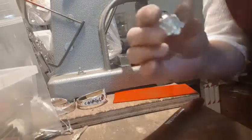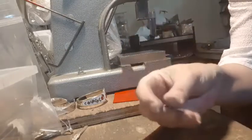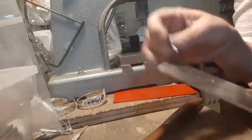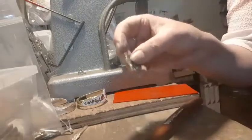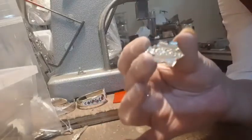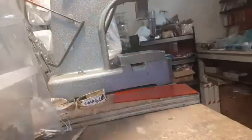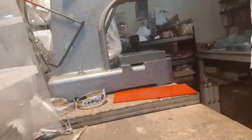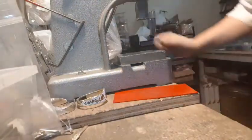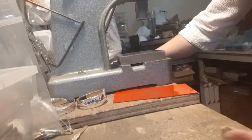So that's going to show you a little tiny flower. He's a little bit stubborn — he kind of curls up — and that's going to show you the intricate detail of some of the flowers. It shows you the little burrs — there are little tiny burrs, so they just have to be filed away. That is one way of cutting these out. I use these pancake dies on my spoon bowls too. Just be careful with the thickness of what you're doing — again, a hydraulic press is your best option.